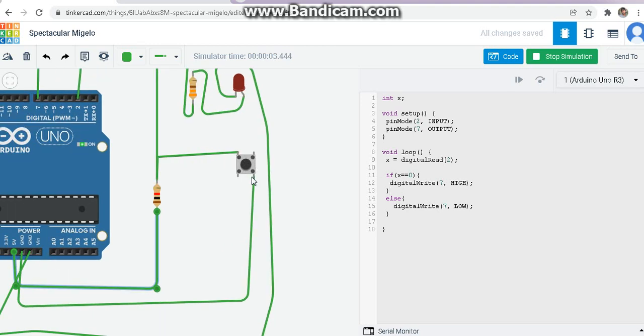Input is low means the button is pressed and switching on is going to happen. I'm going to press the button now. I have pressed it and I am keeping it pressed — I have not released the mouse cursor yet. The button is still being pressed, so low or zero is going to pin 2. According to the if condition on line 11, the LED is on.